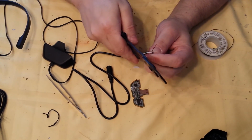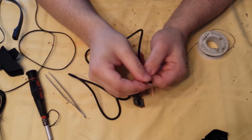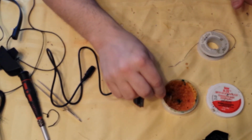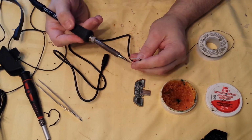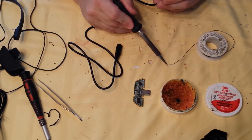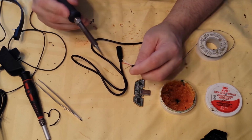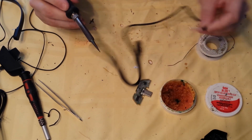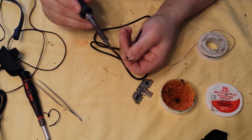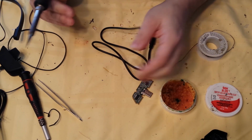Now just kind of use your wire strippers on the red and white cables and just strip off enough at the ends. I like to use some solder flux, kind of just dip my wires in there, kind of tin them up. There we go. Oh, didn't dip it. Get that whole twisted cable that you made and just kind of, there we go.